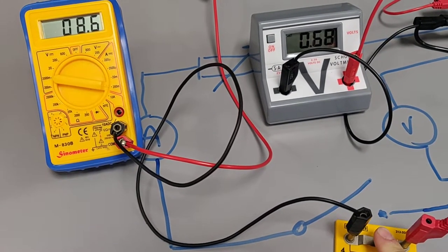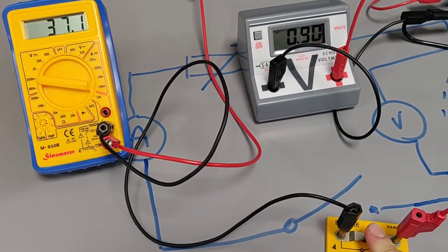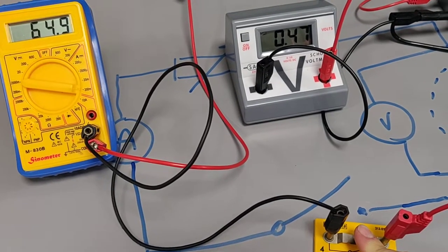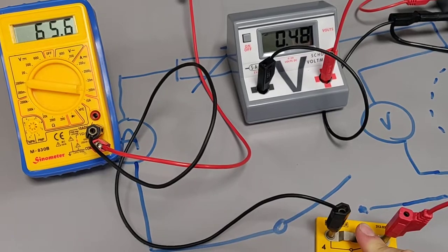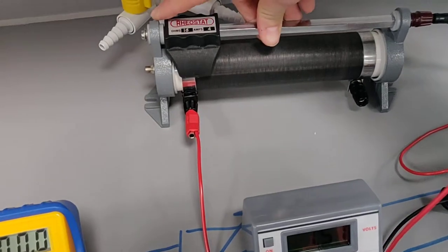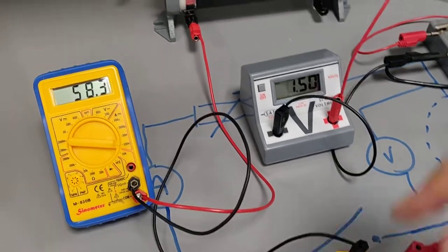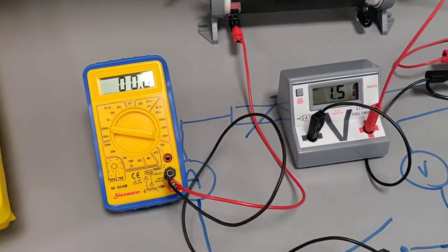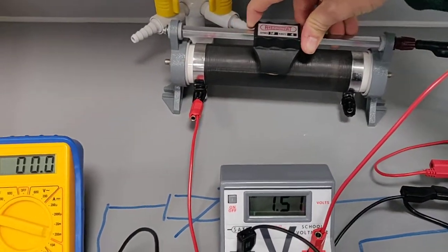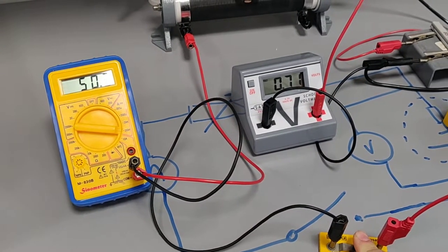As soon as I allow current to flow in the circuit, you can see the terminal PD is reduced. The reading on the ammeter there is in milliamps, and you can see there is a little bit of fluctuation. Students sometimes find that hard to cope with, but they need to estimate where the value is. Then what you do is you simply adjust the load resistance in the circuit on the variable resistor and take another reading and repeat the process. And then you're going to plot the current against the potential difference, and you're going to find the gradient of that graph to work out the internal resistance